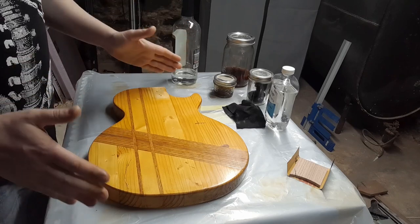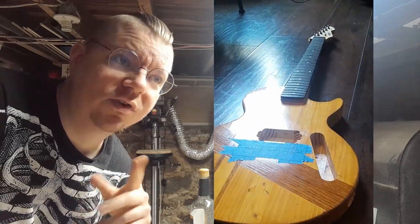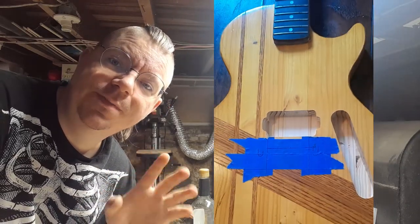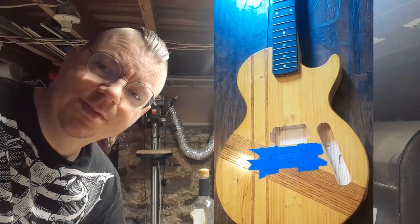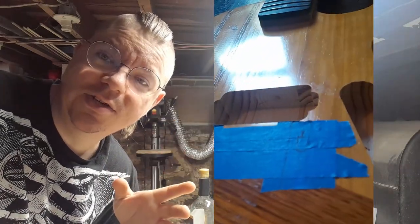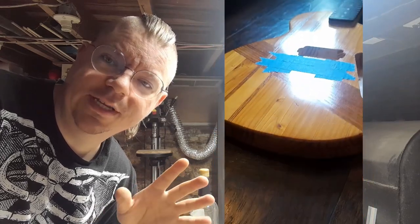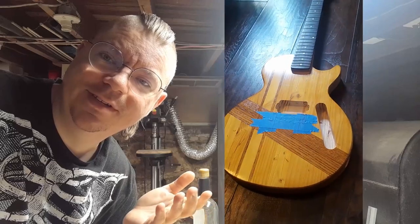One pass — that's all I'm doing here because I don't want to build up those ripples and imperfections again. I'm going to let that cure and walk away from it. As I feared, I did overwork it a little bit and pulled back too much of the finish between the ghosting technique and the sanding technique. Unfortunately I'm going to have to add a couple more layers that hopefully you will not, because you'll pick one of those two techniques rather than both. We'll be back with the next installment once I've routed the cavities and I'm ready to put it together and show you all of the wiring and demo clips.